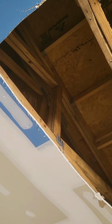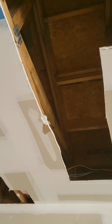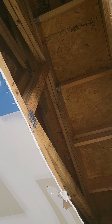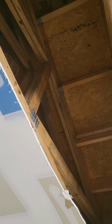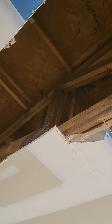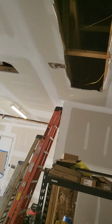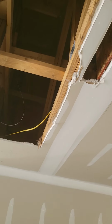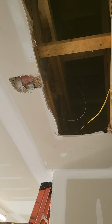So we could see how the replacement framers frame the overhangs. I don't know if you see, that's one of the repairs. If you see that perpendicular 2x10 with the hanger on it, that's what the plans called for. And then on that side, when the fly rafter bears on top of the girder, I don't know if you can see it, there's a hurricane tie down. And they're supposed to be on every one. So Hunter and Doobie have been up here sweating their balls off, going back and correcting all this according to the plans and according to the direction of the engineer to correct it.